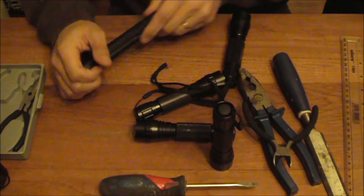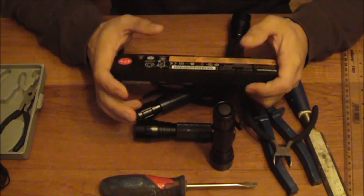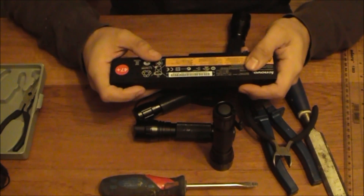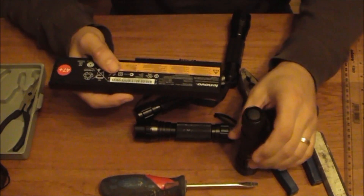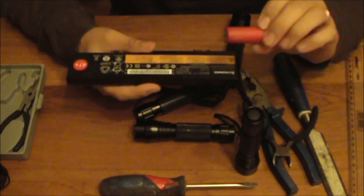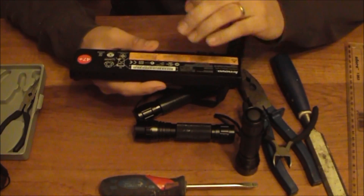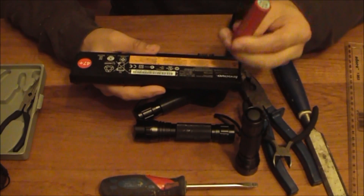It's important to remember that the battery itself will contain unprotected cells. So if you're considering torches that take two or three cells, you need to be really careful — I wouldn't advise running unprotected cells in a high-power torch where it takes more than one cell. The protection circuit inside a laptop battery monitors temperature, provides short-circuit protection, over-discharge protection, and cut-off protection. Once we've taken the batteries out of the pack, all that circuitry is gone and we're left with an unprotected cell.